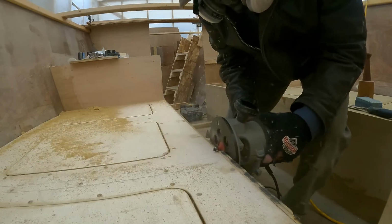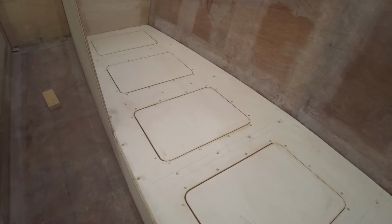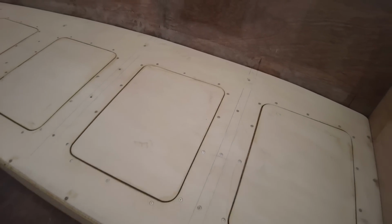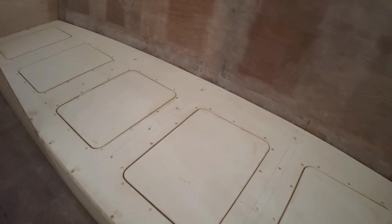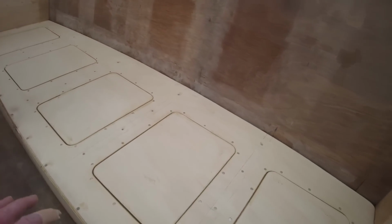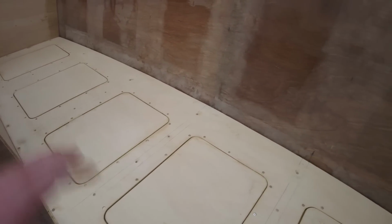And then once that has happened, as I had mentioned already, what we're looking at is 5 little watertight compartments. Well, I won't say watertight because the lids or the hatches here are obviously not watertight, but they are about 3 or 4 inches above the water line. So if there is a hole at the water line or below and water comes in, it can really only stay in one of these bays. The hole would have to be a big long gouge to fill up several of them. But even so, it's still contained.